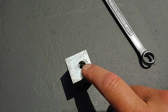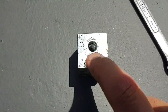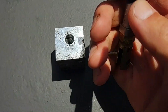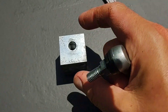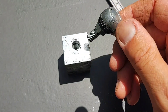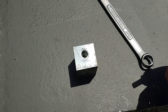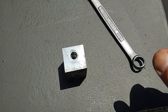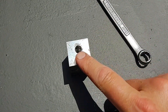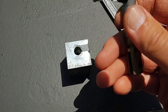You can actually see there's a gall mark here, so it was probably over-torqued and that broke the thread — it was just a matter of time. When this got loose it would just be flopping around in there with a lot of play in the joystick, and then somebody cranked it way down.